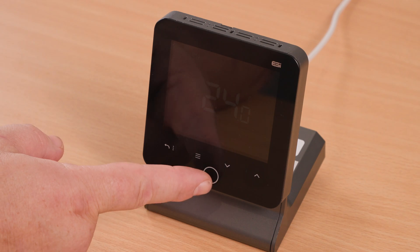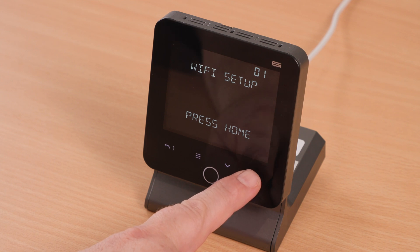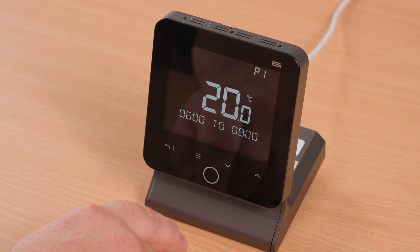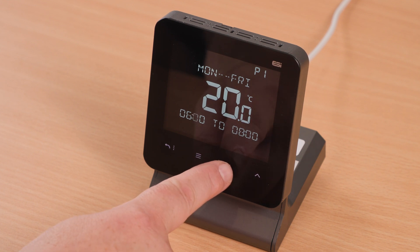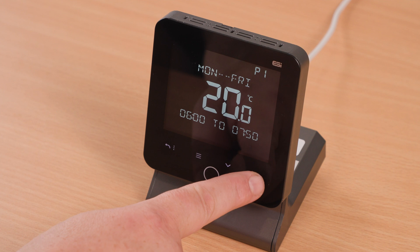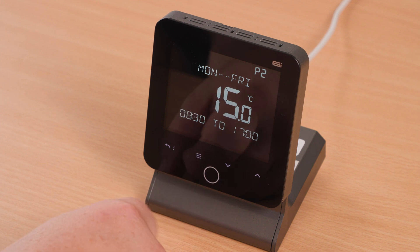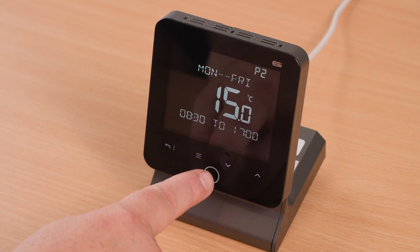Setting programs. Press the home button to activate the thermostat, then press the menu button and the up arrow until you get to 'Heating and Hot Water Schedule'. Press the home button to enter, then press the home button again to set the schedules. Press the home button for your first hours selection and use the up and down arrows to amend the first time — this is the on time of your heating. Press the home button to move on to the setback, or commonly referred to as off time. Follow this pattern to set your program from one to four or one to six times, using the home button for next and the up and down arrows to amend the times.